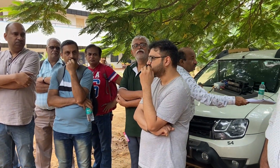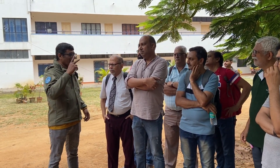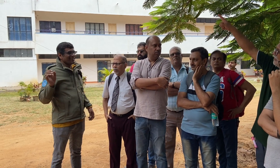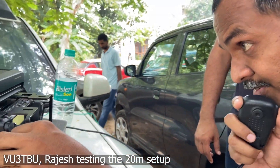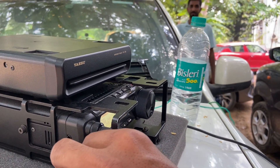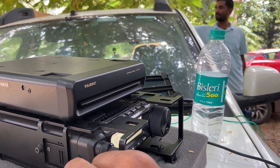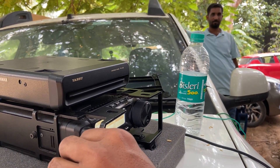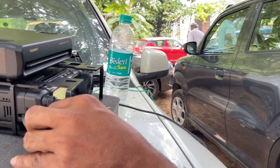Take a fiberglass fishing rod, put a wire onto it, and hook it onto the top. The largest fiberglass rod you'll get in India is 5 meters — anything above 5 meters costs three times as much. The transceiver was off, I just switched it on to check what the difference is. It's not QRP — it's right now on 88 watts. Negative, because it is currently tuned for 20 meters — it's a vertical with all the radials. If you tune into other bands it will be a loss.